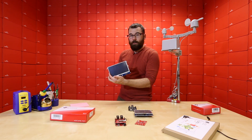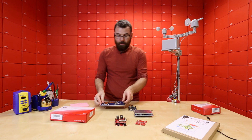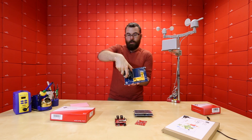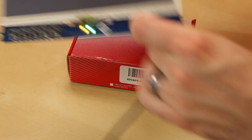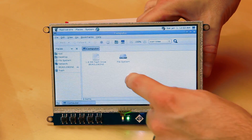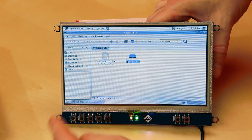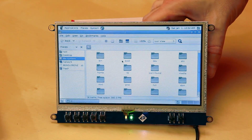We're going to use the 7-inch display and get it installed with the BeagleBone Black. Line up the BeagleBone Black so it hits the headers facing down — not hanging over the edge. Step two is to take your power cord and plug it into the bottom. That's all it takes to get this up and running. You now have a 7-inch display embedded with the BeagleBone Black. In the computer menu you can see all the buttons at the bottom — left, right, and enter — which are already pre-programmed, making it a pretty cool integrated display for the BeagleBone Black.